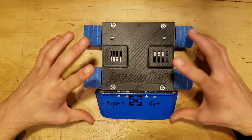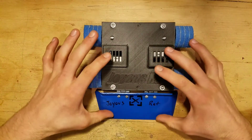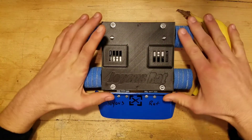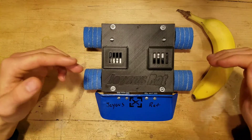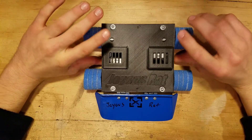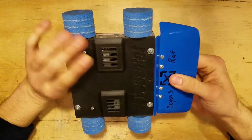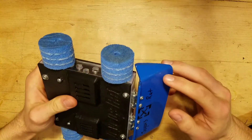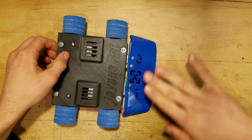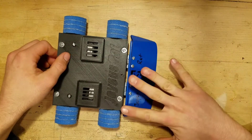Here's the robot — pretty basic construction, and this thing is actually quite big. Here's a banana for scale, fairly decent sized robot. I don't think I mentioned it yet but this is a US ant weight, so one pound. It has this articulating plow in the front — I just made this out of Lexan. I put a few bends on the sides here to deflect horizontals up onto the plow, and this lip back here to prevent horizontals from hitting into the frame.